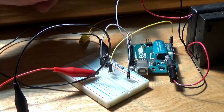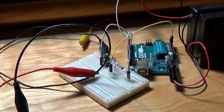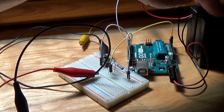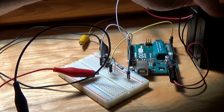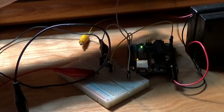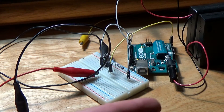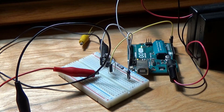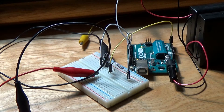Then obviously you've got your power supply, ground, and antenna. It's a little chunk of software, not very long. I made a power pack — these have four double-A batteries in each, wired in series, so we've got just a little over 12 volts when they're fully charged. I wanted to make it more mobile, so there's no power supply — just batteries — to try and eliminate the noise from the USB cable when it's not transmitting.